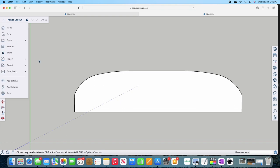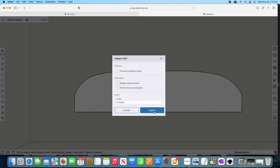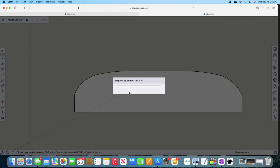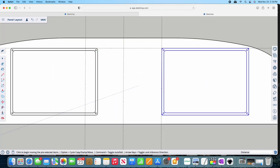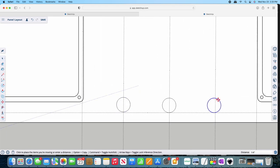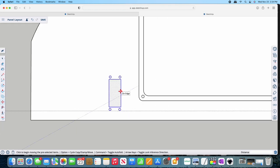From there, I started laying out our panel. Many of the Garmin products have CAD files for their components that can be downloaded and loaded directly. If using SketchUp, you do need to have the first tier of their paid subscription. Then, most of the other components had drawings in the documentation that were easy to sketch out with their specified measurements. One final thing I did was make several reference points that we'll use in the next step.